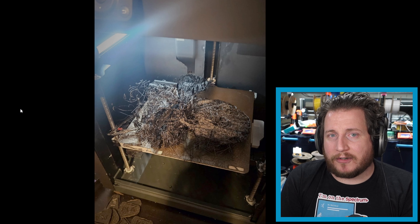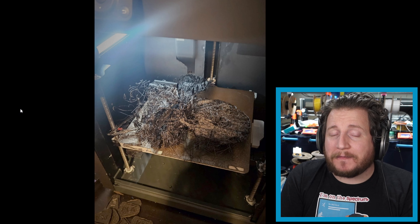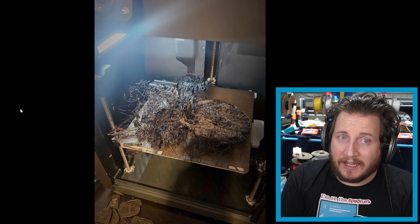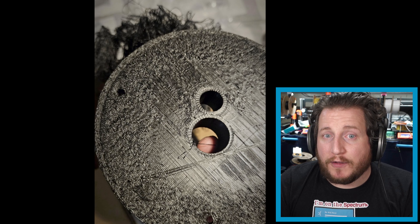I would do 80 to 85 degrees Celsius on the plate and at least 255°C for your first layer and 265°C for the rest of the layers. With PETG, similar to PLA, it's easy to tell if you're overheating or underheating the plastic: is it matte or is it shiny? If it's shiny, you're good. Is it stringing? It's too hot. If it's matte, it's too cold — crank those temperatures up a little bit, and you can do this mid-print, no big deal. But if you're starting the print too cold, nothing's going to stick.